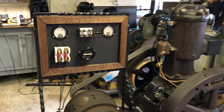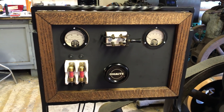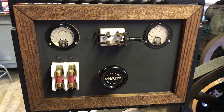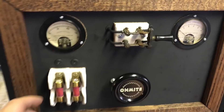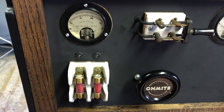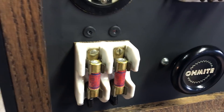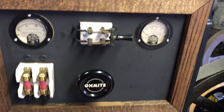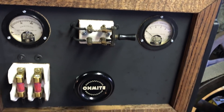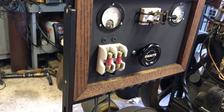So you remember on Friday I showed you the layout for the control panel here. Well, here it is almost completely assembled. The front panel is done for the most part. I added this fuse holder here as a last-minute addition, and I just happen to have these new old stock Eagle 15 amp cartridge fuses. Got the field switch wired up, the voltmeter and ammeter installed, the field rheostat installed. I think the frame itself came out pretty well. I'm happy with that.